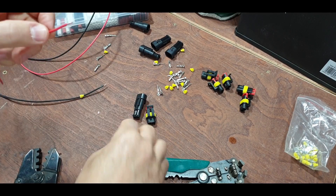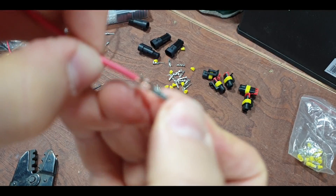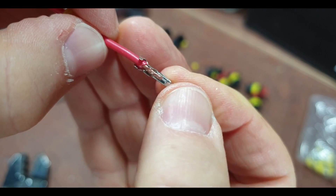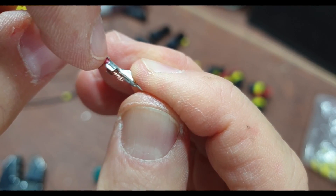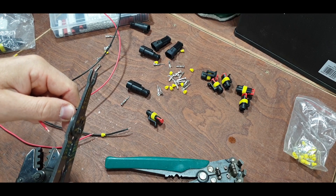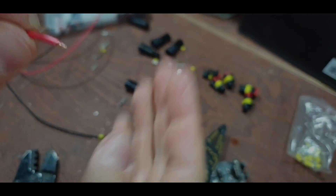So I would always twist them. Now these are stripped, we'll just check to see if we've got too much copper sticking out - and yeah we have, see there's too much. That's where it wants to be and that's where it is. We want the insulated jacket to be crimped by this large one here, and then just enough copper to be crimped by the first one. So I'll chop that in half and do the same for all of them. There we have it - just give it a little twist. Not so much sticking through now.